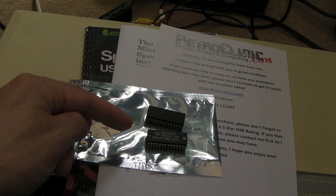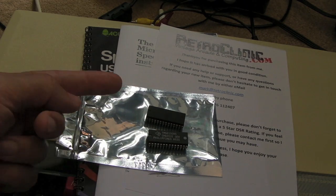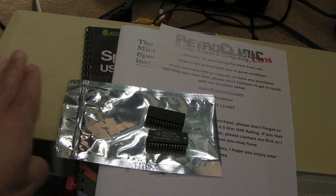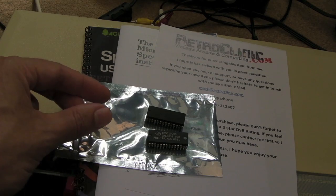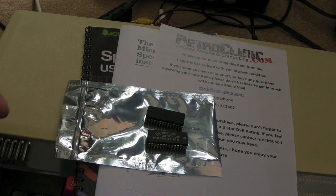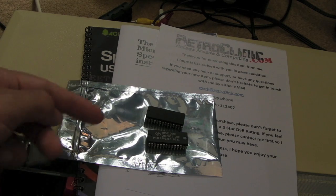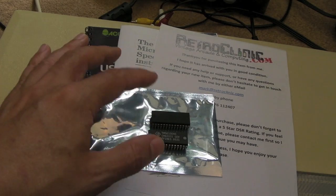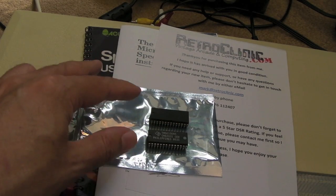But where I started with this was, let's try and play some of the arcade sounds on this chip. And then I started thinking, actually, it'd be really cool if we could modify Star Wars. What you could do is stick your ROM data, the samples, in sideways RAM, have a playback routine in that sideways RAM, and modify the original Star Wars game code for the BBC version, so that at various points, when certain things happen, it makes calls to the playback routine in the sideways RAM to play a specific sample. I can't imagine that being out of the realms of possibility. I would suspect it would be possible. You could do it with Star Wars, Empire Strikes Back and Return of the Jedi, because all three of those games exist for the BBC.